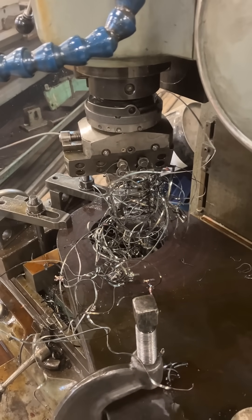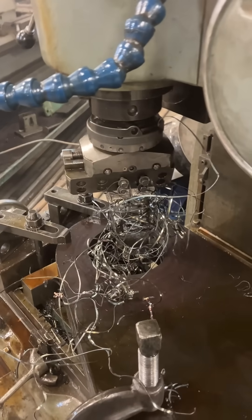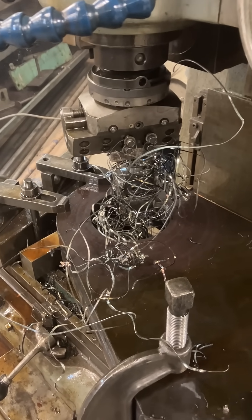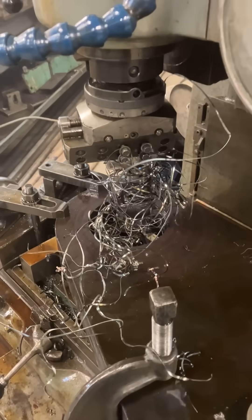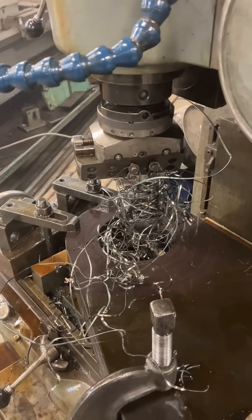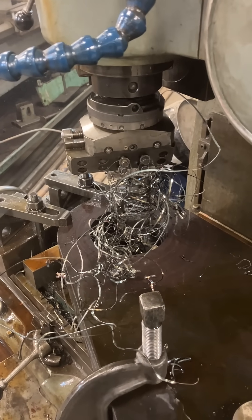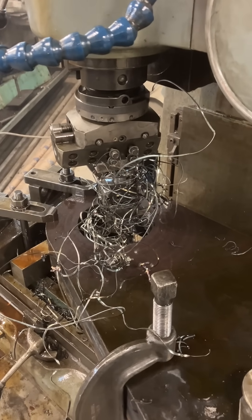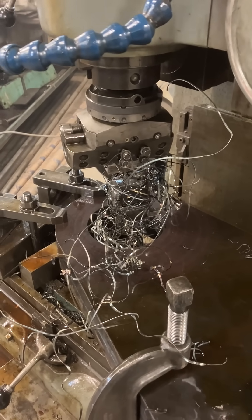The chips are not brittle — they don't break easily. They have to be pulled out and cut, and they resist that. So that's a real time-taker on your job. You have to consider chips as being part of efficiency — if you can have them removed without having to deal with a bird nest like this.